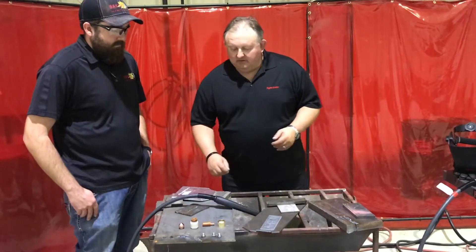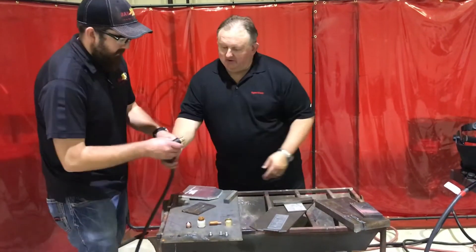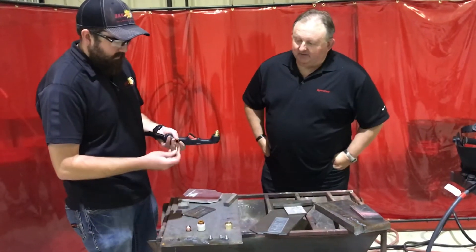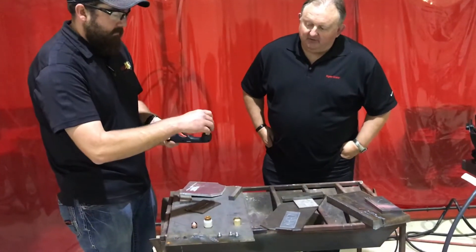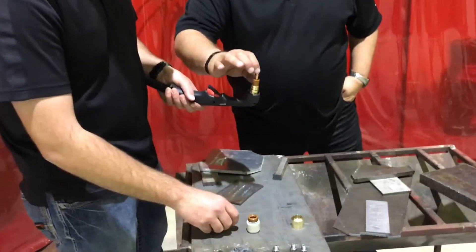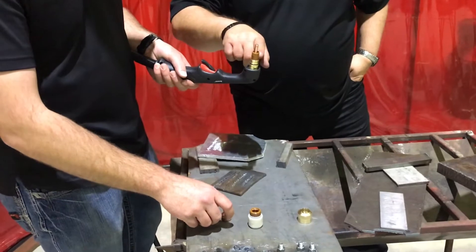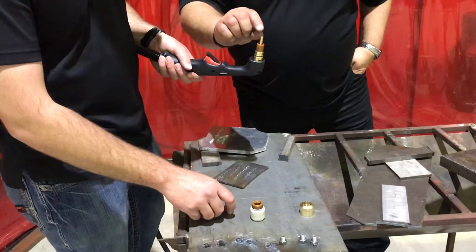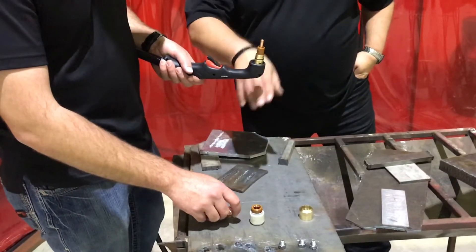What we have here are the parts and they're very simple to put in. You have five basic parts: you have your electrode and your swirl ring, and they just go together just like what Andrew's showing you. These are different than our normal set because they have a little bit different airflow — some cuts in the bottom that make the airflow differently. This electrode is a little longer than our standard cutting one because it had to be in order to engage this right.